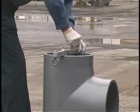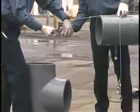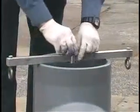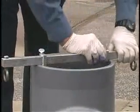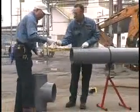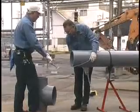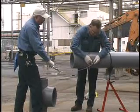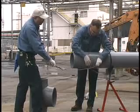In this demonstration, the IPS pipe puller tool is used to assemble the joint. The socket bar attachment, used for inline fittings, is placed equal distance over the center of the socket entrance. Two adjustable locks keep the bar centered on the fitting so that an equal, even force is applied. This keeps the fitting from cocking to one side and producing a large, undesirable gap. Force is transferred from a cable winch to the socket bar and other attachments by means of a cable yoke that splits the force and helps to produce an equal, even amount of tension necessary to bottom out large diameter fittings.